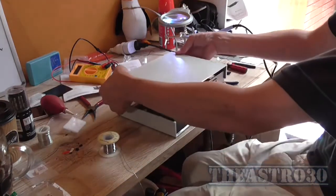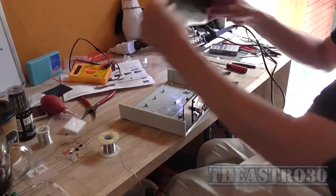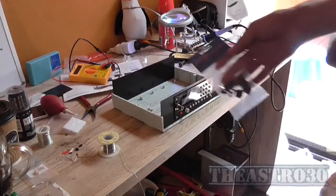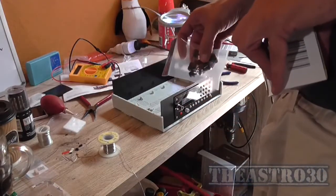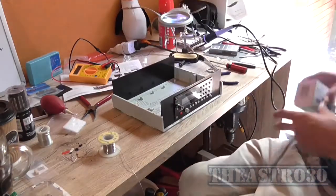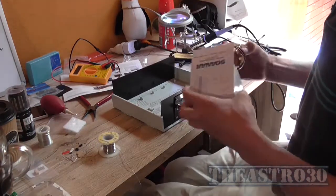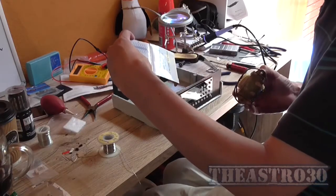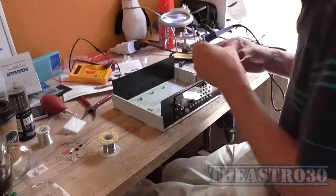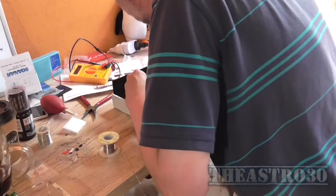And for that I'm going to need something else that I bought from frickin' hell. No, I didn't buy it from frickin' hell, I bought it from JYETech. Got a packet of strain reliefs that you put your cable clamp, you put the power cable through. So I'm just going to wire up the mains cable directly, and I've got a transformer here. This one is a multi-tapped 12 to 18 volt, 18 VA 1 amp, and it's an MM2011, and so that will mount wherever I can mount it.